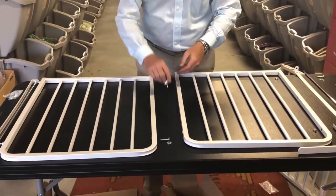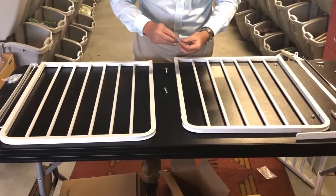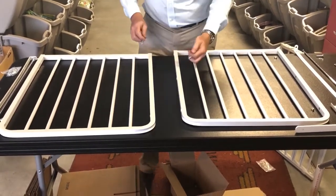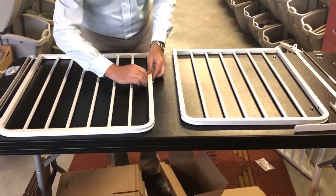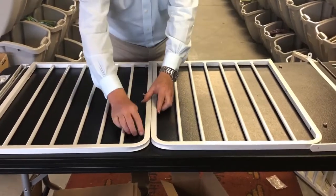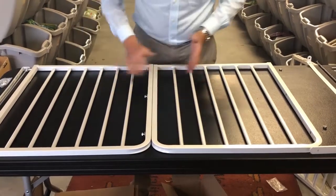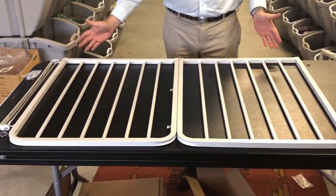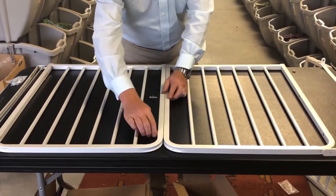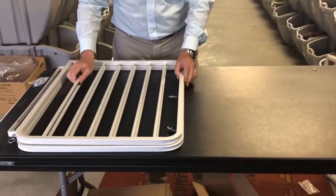They are 1 1/4 inch, quarter 20 hex head bolts. And what you're going to do with this is connect this extension to this extension. That's all connected. So that's about 44 inches of span right there. Now I'm going to take this away and pretend that this is our full fence at this point, because I need more space here.